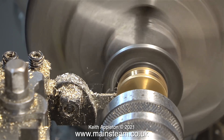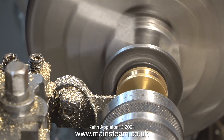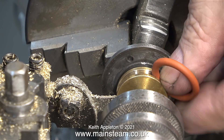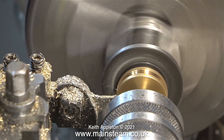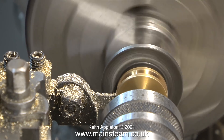As I cut the groove for the silicone piston ring, I'm not going to cut it quite as deep as I normally would, because when the silicone piston ring is fitted to the piston it needs to be pushed outwards very slightly. I can feel where the piston ring is by using my thumb, and I estimate that if I deepen the groove by about two thousandths of an inch, the piston will be held against the cylinder wall to successfully seal against the oversized cylinder bore.